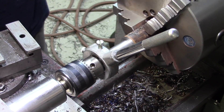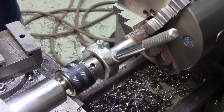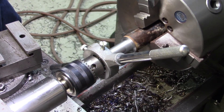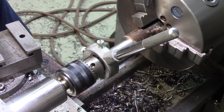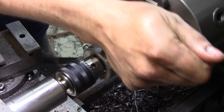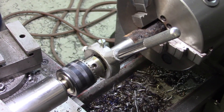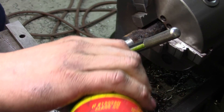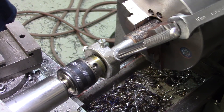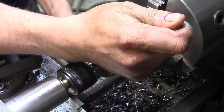Using the drill chuck on the back side helps to keep the die straight as it starts. Even if the handle looks crooked, the die has to be at least somewhat square. Yes, I could single-point thread this, but I'm actually feeling kind of lazy tonight.